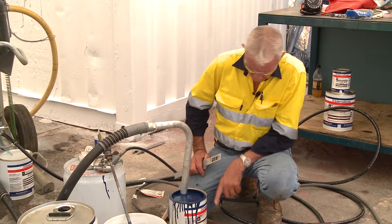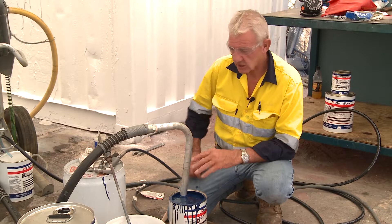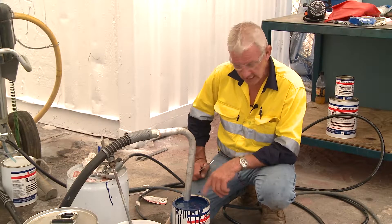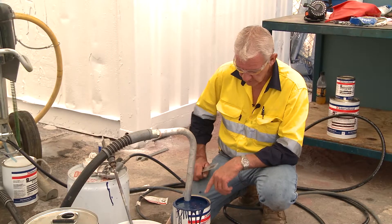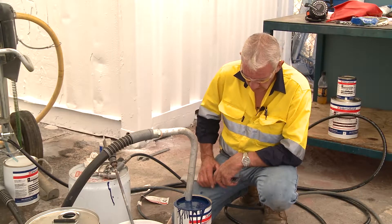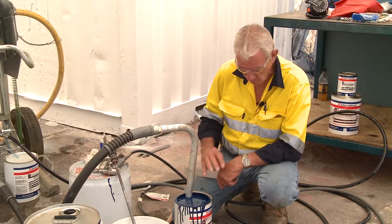However, because it's acrylic polyurethane, it needs a little bit of solvent to help with film formation. The pump can pump that no problem, but you have to understand the characteristics of the product to enable a good film or finish at the end of the job. So because this is a polyurethane, I've added 5% solvent, which is more than enough to help with film formation.